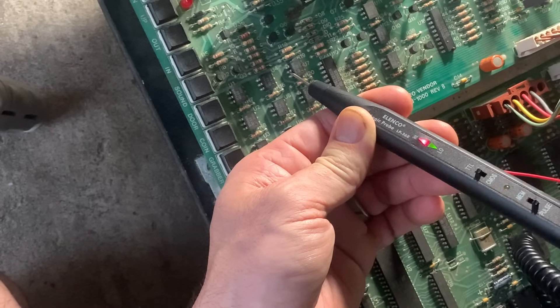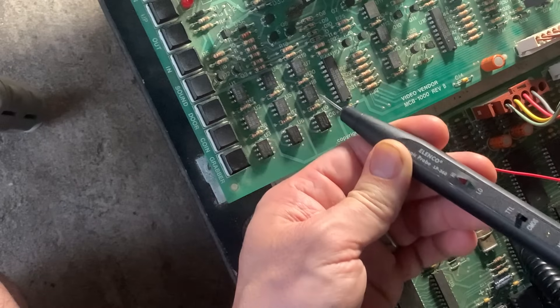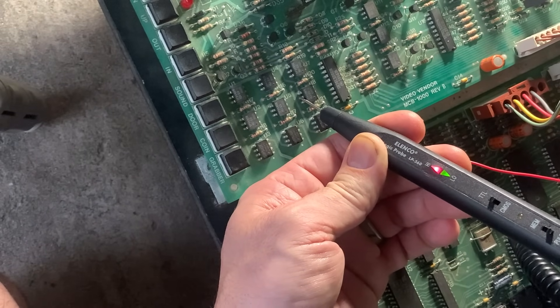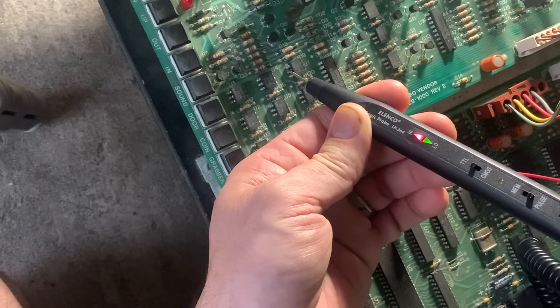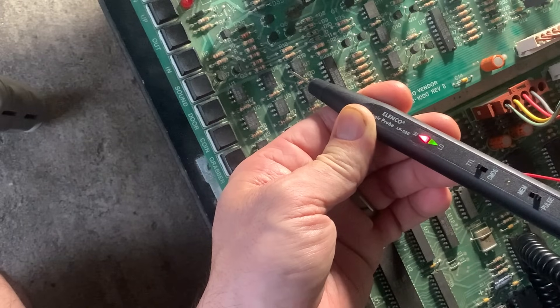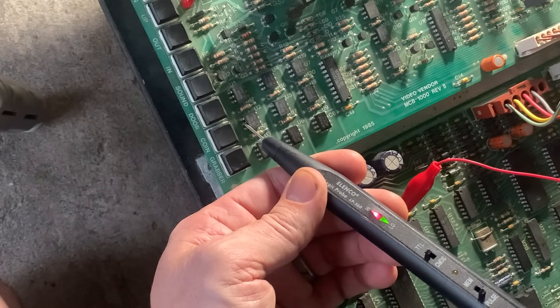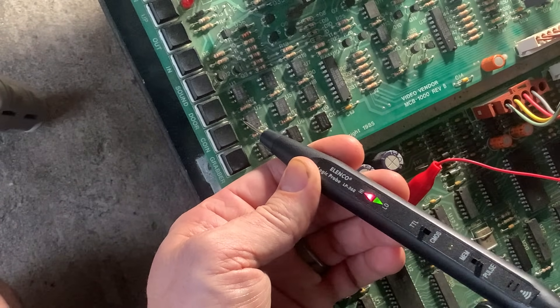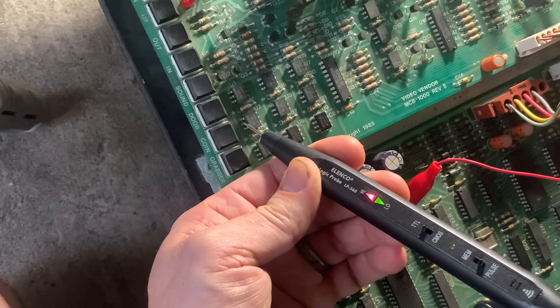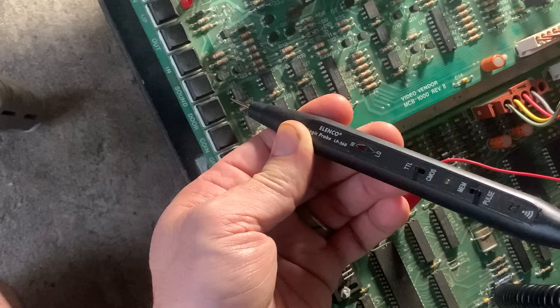Here I am making the transport move by touching two little pins — it's pretty awesome. We're going to need to see some activity on the output side when I hit the buttons. I hit the button on the keypad and nothing's coming through. So the other side of the optocoupler is failing, and that's actually pinpointing our issue. We're going to need to buy some optocouplers.